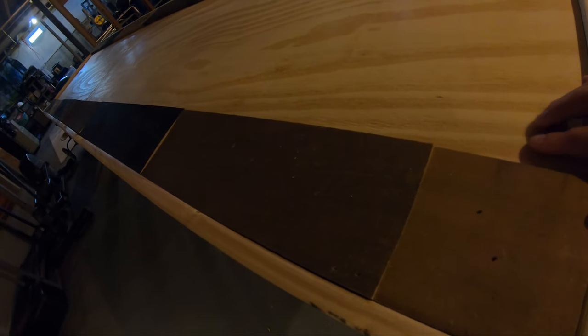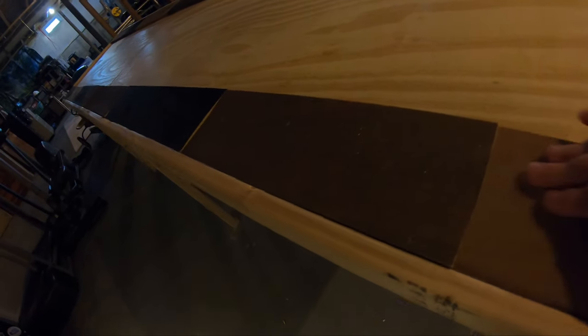And then there are tiny little gaps, and the joint in the middle of the table. I'm gonna put some kind of foil tape underneath to stop the resin from seeping through there. If it floods over on these sides a tiny bit, that's gonna look cool, 'cause it's gonna be nice and shiny. And also, if it doesn't, I'm just gonna poly this at the end.